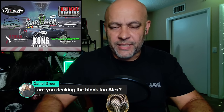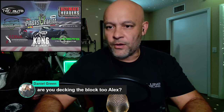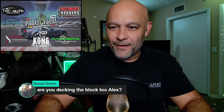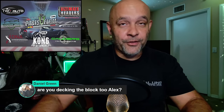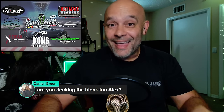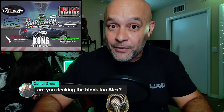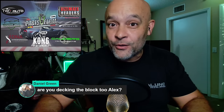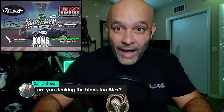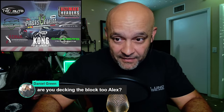Now, some people would say, what's the problem, Alex? Those gaskets are badass. I understand that, and that's all fine and good. But what am I paying for? What am I paying for? And then when you see that the valve cover or the cam cover gaskets are OEM Ford style blue gaskets that stretch when they hit oil, because it's a dissimilar material that the oil attacks and you cannot reuse it, it makes me go, why didn't you just charge me an extra $30 for the Felpro stuff?